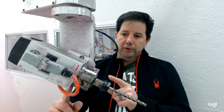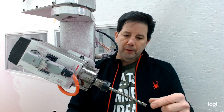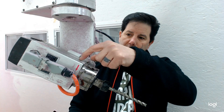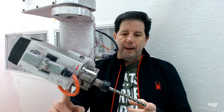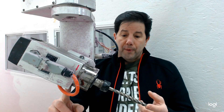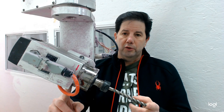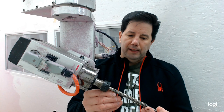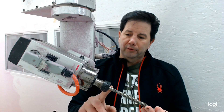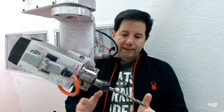One advantage of this particular machine is there's only one articulation point or one offset — everything is perfectly parallel to the actual shaft itself. The Z-axis comes down to the middle point, and the A and B axes come right to that same middle point. So this is the only articulation point the math has to take into consideration. What I have to do is go in and set my tool length — in my case I set it to 235 millimeters. When I make a tool change, it's a bit of a pain: I have to use a caliper and measure the tool length, accounting for the articulation, to get to 235. The problem is trying to get that right every single time.